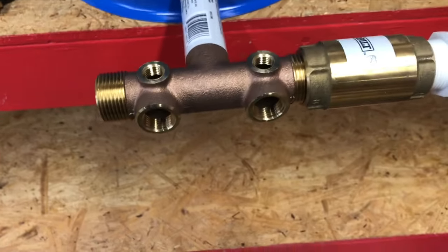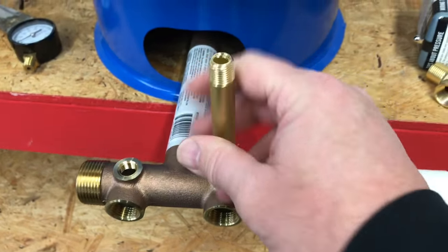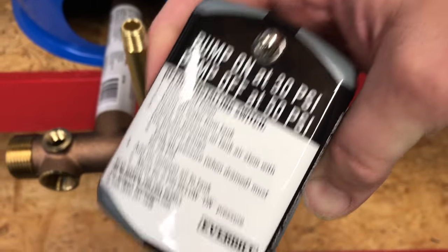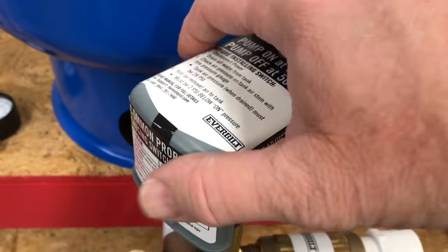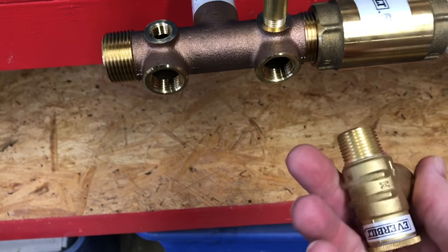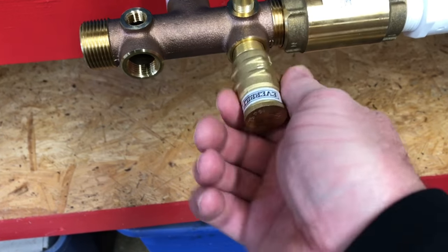Now let's move on. What we're going to put right in this hole here is our pressure regulator. So we've got a four-inch brass nipple and we're going to screw it in and tighten that down. We have our regulator right here — it's a 30 to 50 PSI regulator. I'll talk a little bit more about that in just a moment, but we're going to screw this in — it threads right into the quarter-inch pipe nipple. Next thing on the half-inch side down the front is a 75-pound pressure relief valve. So if something was to happen and the pressure got higher than 75 pounds, it would pop this valve and shoot water straight down on the ground so it wouldn't blow up your tank — just a safety feature to have on there.